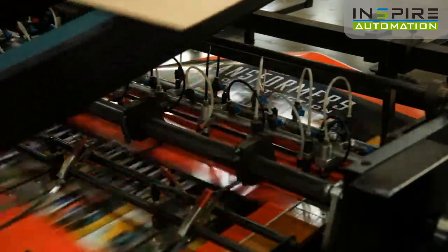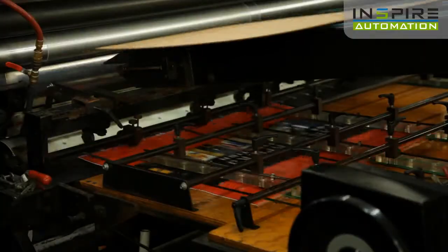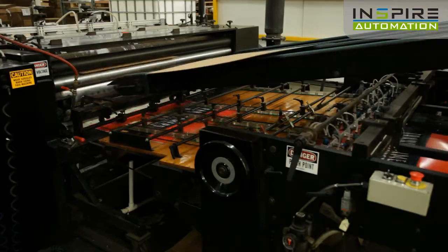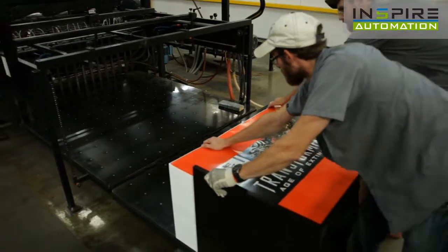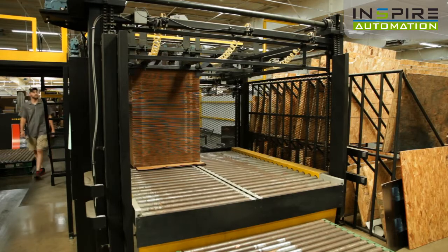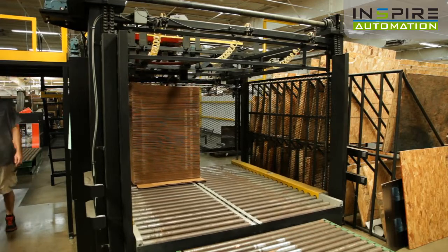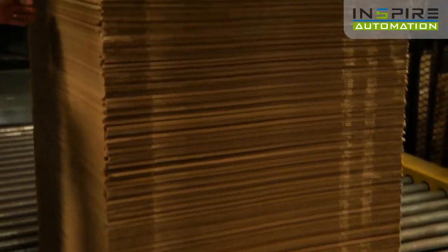Independent suction valves operate on one feed head, providing consistent feeding and fast setup times. It can handle an 8 by 6 inch label all the way up to an 82 by 65 inch label. The movable air deck allows the litho sheet pile to float into position using only the slightest of pressure. This EM is employing the 82 inch optional downstacker. We also offer a 120 inch version, both with non-stop and powered outfeed conveyors.